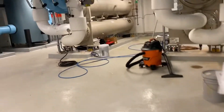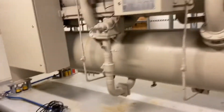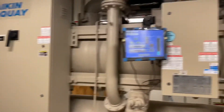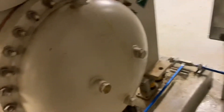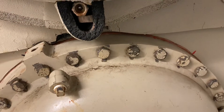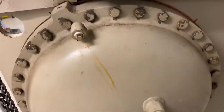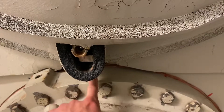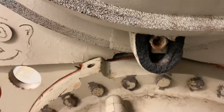We got this chiller draining down here — these are two Daikin magnetic bearing chillers. We got this one switched over this morning and this one off. This is the head that we're taking off. Yesterday we punched tubes on this one, but what we ended up doing is rotating the head so we can get the eye bolt in here, because that was kind of an issue. The eye bolt was sticking up right here so you couldn't get it on, so we angled it a bit so that next time we have to take this head off we can get in there pretty easily.